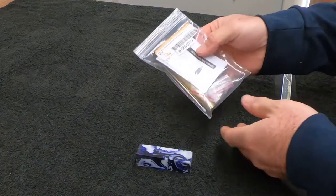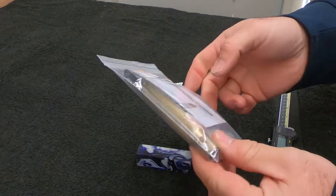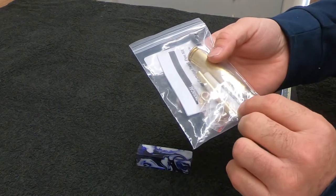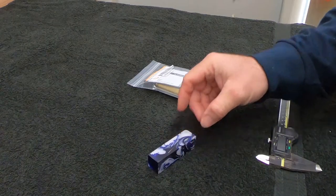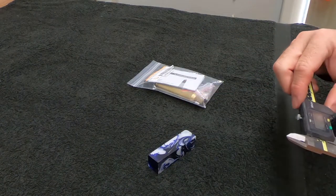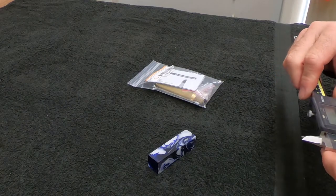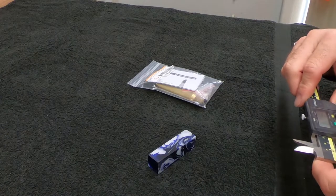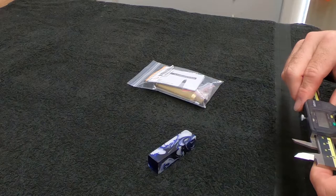This is a PSI 50 caliber pen kit. That's what we're going to be making today with this blank. The kit has dimensions for your blank to be at 1 3/16 to 1 7/8. I like the shorter version of it better. I think it's more authentic looking. So I'm going to go 1.18, which would be 1 3/16. We'll mark it and then cut it at the bandsaw.